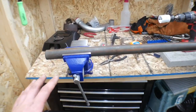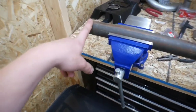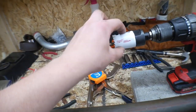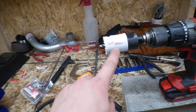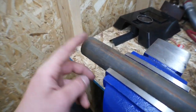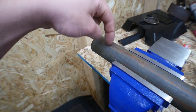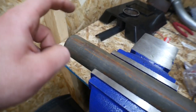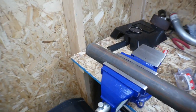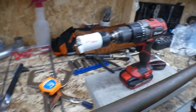Now that the plate is welded up, I want to put the pipe in the vise and try to make it into a little U-shape. I have a one-and-a-half inch Milwaukee hole dozer and I want to see how it works on a round surface — it might be a little tricky to line up. It has a small drill bit on it so I might punch the center point right on the edge so the whole circle of the hole dozer is on the pipe, then give it a shot. It's pretty thick pipe, so hopefully it goes through quickly.